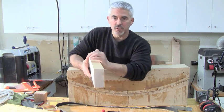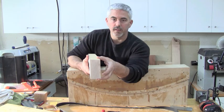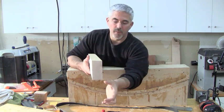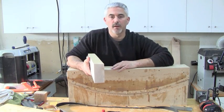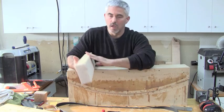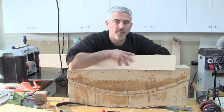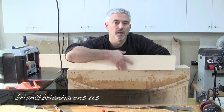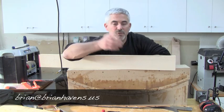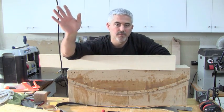The stock I'm going to use for the front apron is leftover from one side of the legs. I took the straight grain for the leg itself, which leaves more or less rift-sawn material that will make nice stock for the aprons, and the grain will match the rest of the legs as well. So that does it for this update on the Asian cabinet project. I'm Brian Havens — if you have any questions or comments you can send me an email. Thanks for watching.